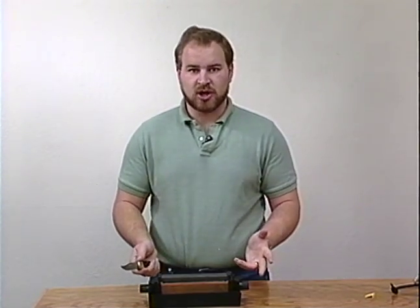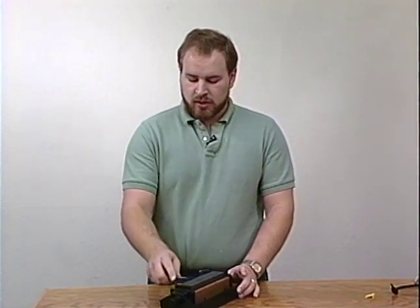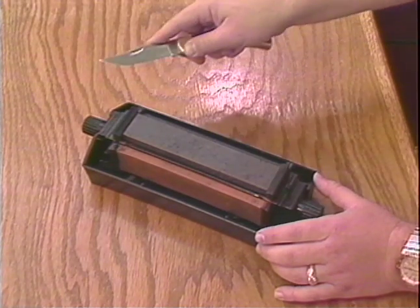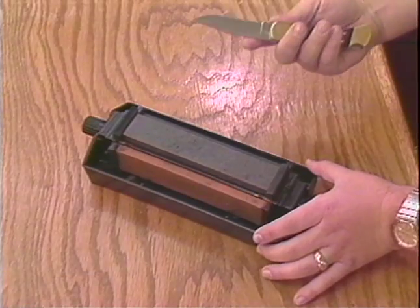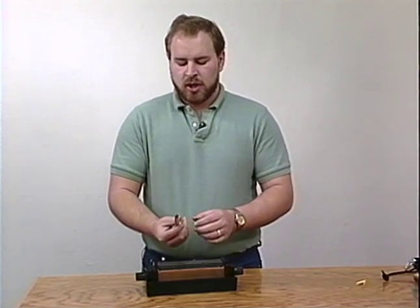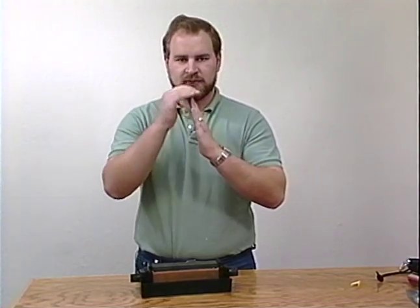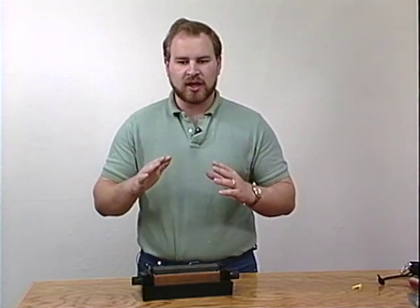If it's not sharp, there are several ways of sharpening it. The traditional way is working it onto a stone. Take the blade, put it at a 23-degree angle, and then draw it into the blade. Don't draw over the back of the blade because you're going to put a burr onto it — draw it into the blade. Why 23 degrees? It's a compromise. If you have a real steep angle, you have very little material at the tip of the blade to support the rest of it — very sharp to start with, but then it becomes very dull quickly and will bend, break, or deform. If you have a very wide angle, you end up with a moderately sharp blade, but it'll stay sharp a whole lot longer. Compromise — 23 degrees.